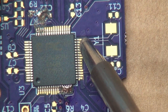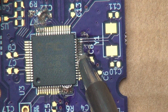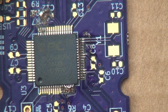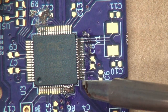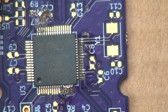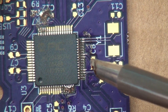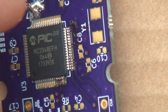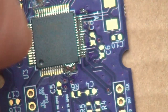And now we're going to drag solder. So we're going to very carefully drag the tip across these pins, just like that. And if you noticed, the pins actually went and took the solder out of the tip, and the tip then basically cleared the pins. It removed the extra solder. And we're going to inspect that more closely here in a second, of course. But just looking at it, that actually seemed to have soldered down pretty well. I need to put a closer eyeball to that. Some of those do look a little bridged, and that's okay.